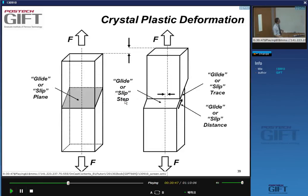Just for your information, just to connect a little bit with what we'll see in the future. When you look at the small crystals in your steel, they don't strain like a little bar, like putty that you pull in one direction and it gets narrow. What you see is that the grains slip. Shearing occurs; there is a shear deformation that causes the strain.